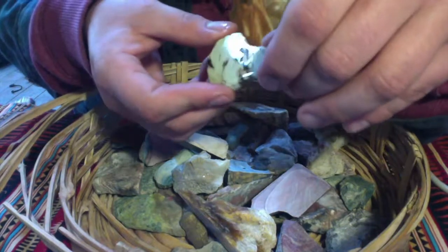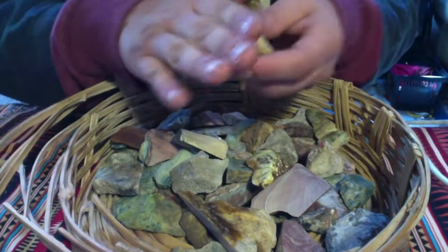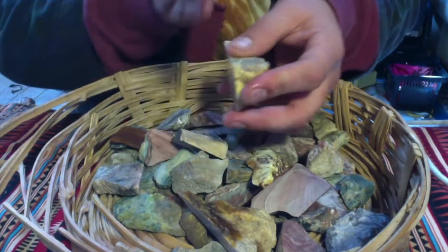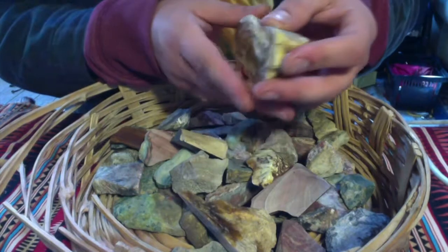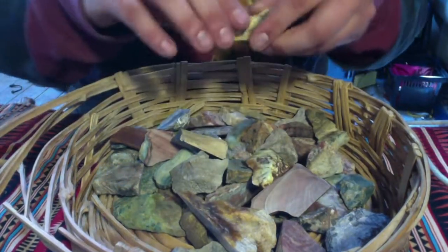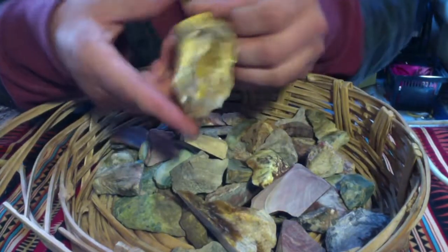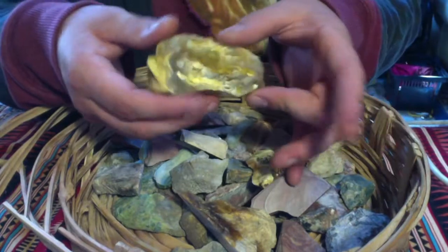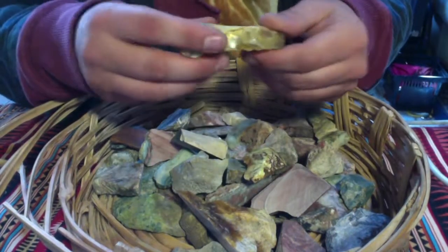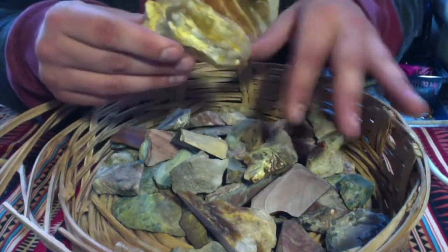All of these stones once upon a time were held in a clamp or glued to a piece of wood and cut using a slab saw or a trim saw. I like to take advantage of the one side being flat, grind out the saw marks, polish it up, and then you're left with a beautiful specimen. One side that's rough or has the natural cleavage, and then one side showing all the goodies.